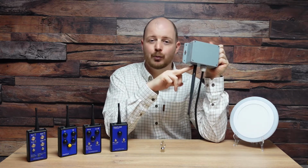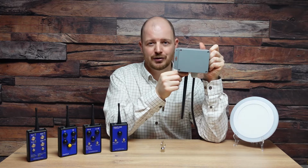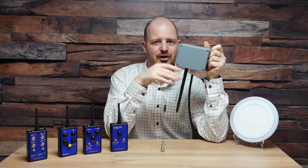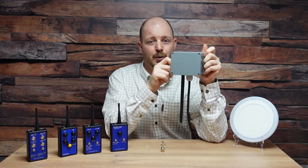Now, we do actually have a waterproof gasket there to keep the water out, but for belts and braces, we point it down too, along with a cable entry gland to stop that rainwater managing to seep its way in. As we all know, rain is pretty good at getting everywhere.